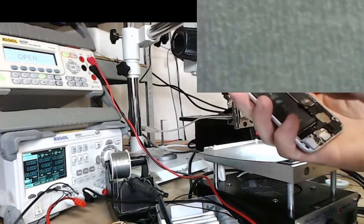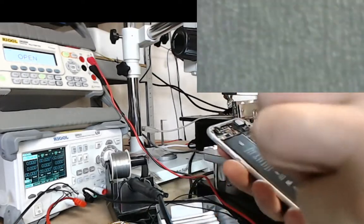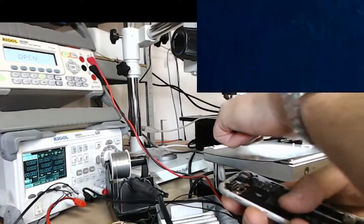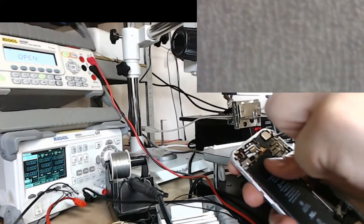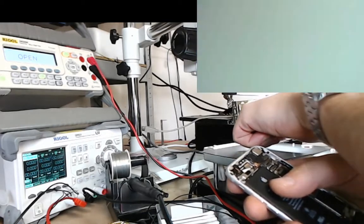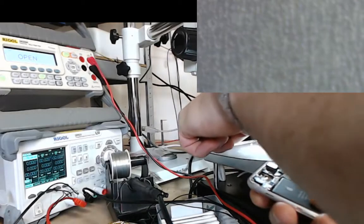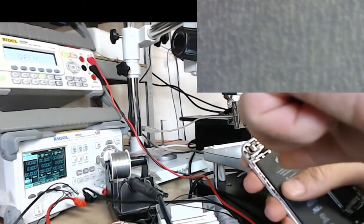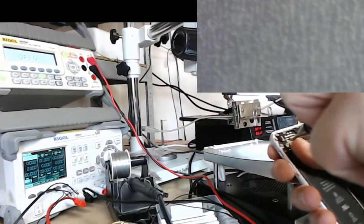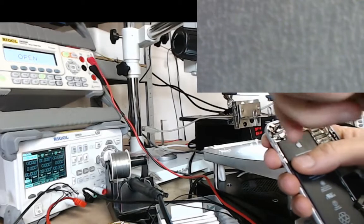Right. So, let's get this board out first. Let's get the screws out. Okay, they've not put the standoff at the top. That standoff there is missing. Okay, that screw there. It's a little bit slower for me to do this on camera because it's me trying to hold the board in view for you to see, which is not the most... Oh, there's another screw missing from there. That's going to give signal issues.